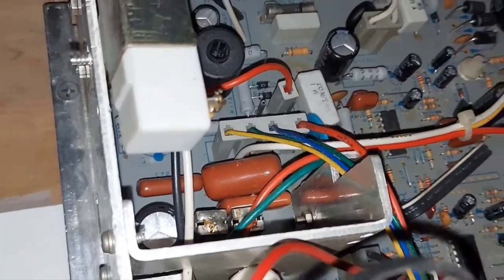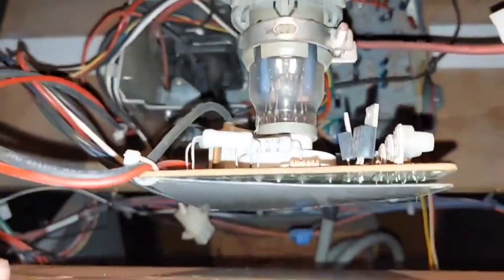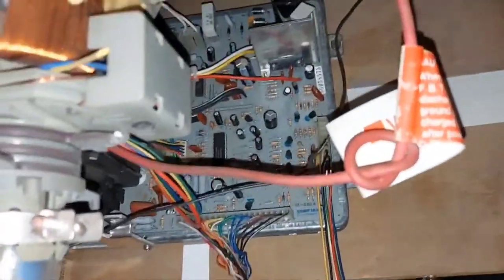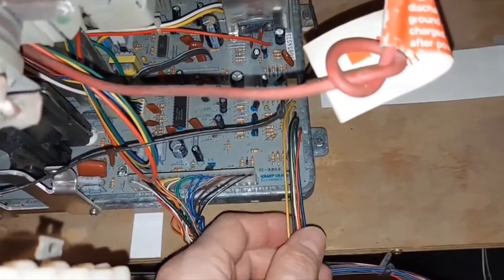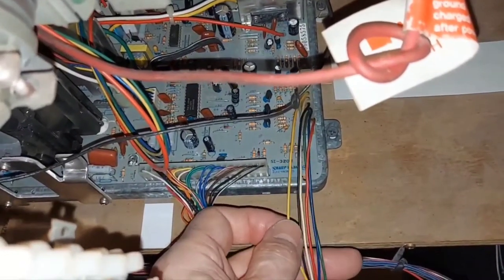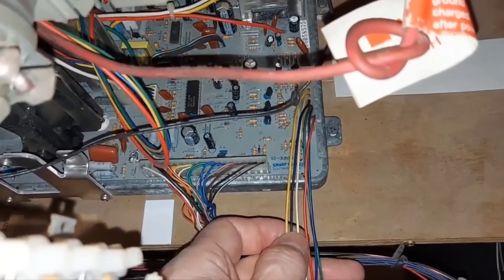The neck board is connected — no problem. Glad I had enough clearance because I didn't really check it, but ended up with plenty of clearance. The video wire — this is your video coming from your PCB — it's hooked up. You've got your red, green, blue, your ground, and your positive sync. It's got both vertical and horizontal positive sync there.